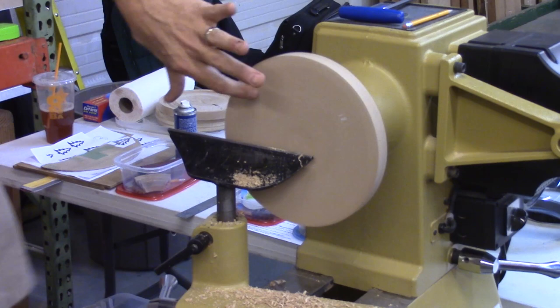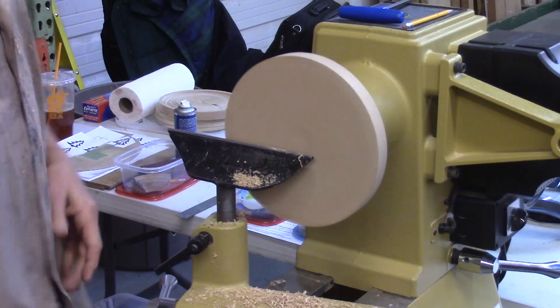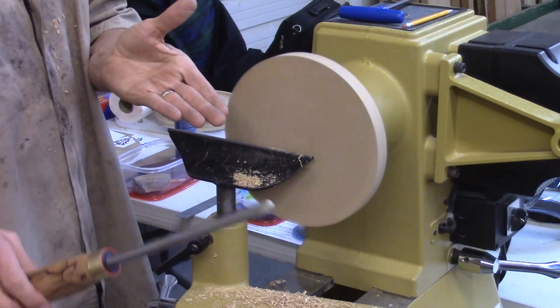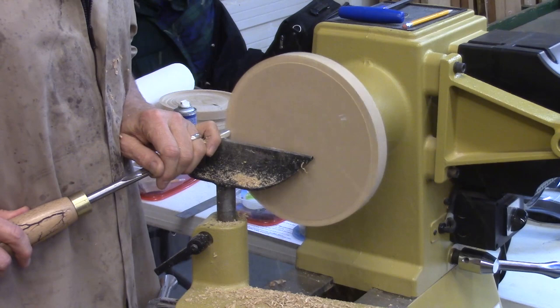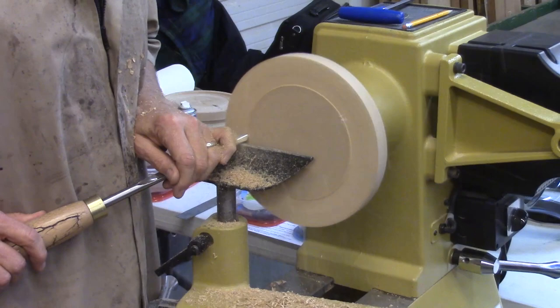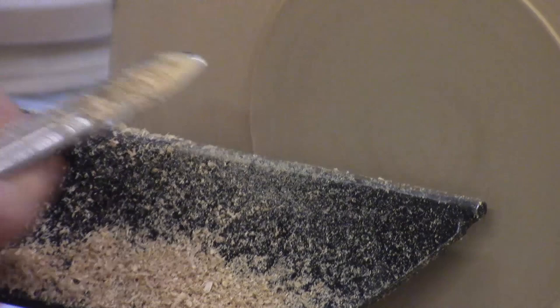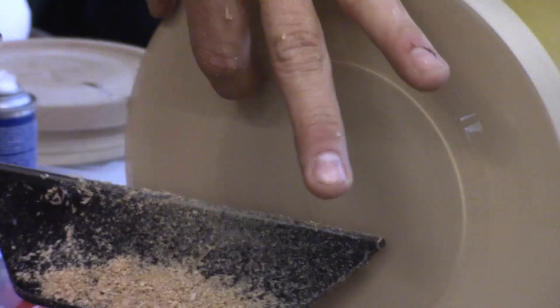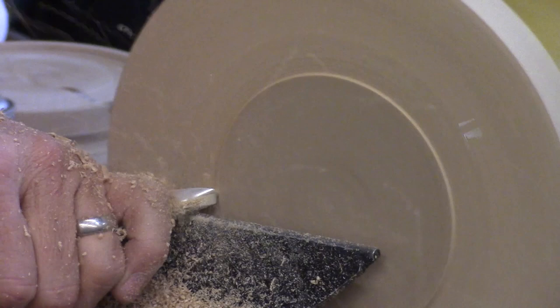This is all about not trusting woodcraft and the quality of the wood — actually it's pretty good. This is pretty flat because eventually I'm going to take two of these and glue them together, so I want a nice flat glue surface. If it's not flat, it's not going to glue really well. I only need about two inches of that outside rim really flat because that's where our trees are going to live — it's on the outside two inches. So let me go a little further.